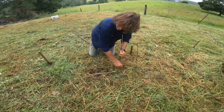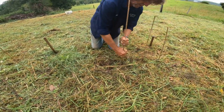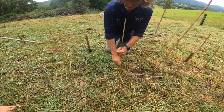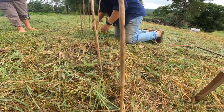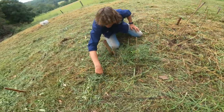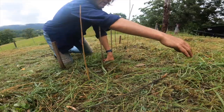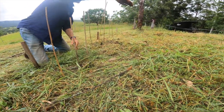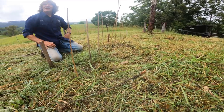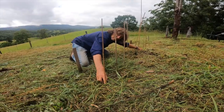So we bring our swale up like this, up like this, up like this. So we've got a straight edge along here. We'll come up like that, and our swale trench is going to go uphill and go wide out here and go back down again. And we're going to leave the mound off here, and that will set the height of the water in the swale. So this is called a level sill.